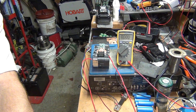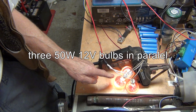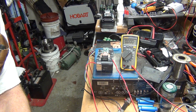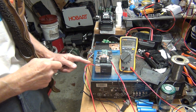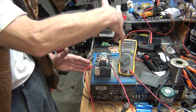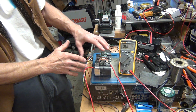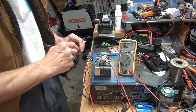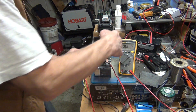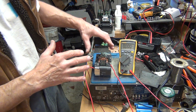These three light bulbs on the indicator are connected to the first pack. You have to be careful because the layout is: this side is 3 cells, this side is 6, this side is 6, this side is 6, this side is 6, and this side is 3. So there are 3 here, 6 here, 6 here, and 6 here — but 3 and 3, because 3 of these are connected with 6 of the others. So when testing, you measure in groups of 3.